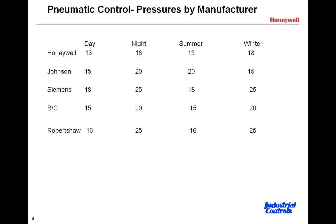The thermostats essentially have two thermostats within them — there's a day and a night — and you have similar control devices within each, but you just stagger your set point. For example, if you want a day setting of 68 and a night setting of 58, there are two identical stats within, but the pressure is what indexes which thermostat into action.